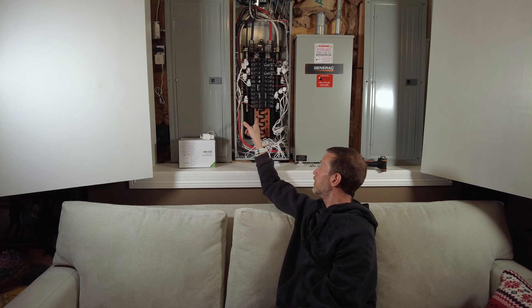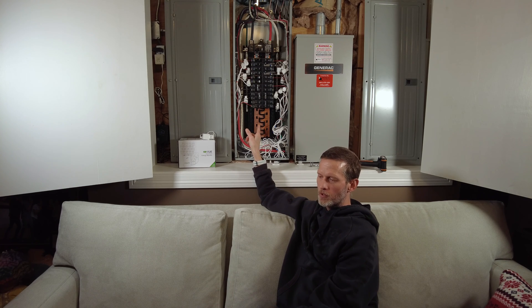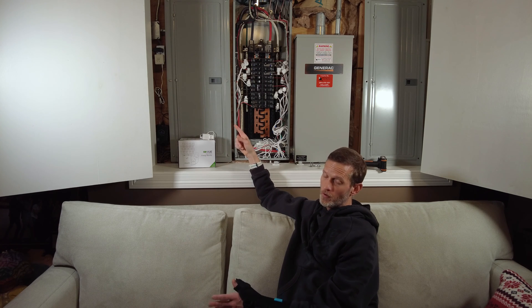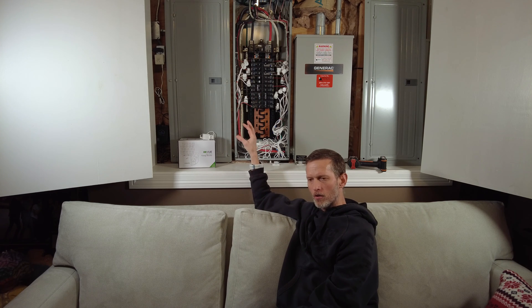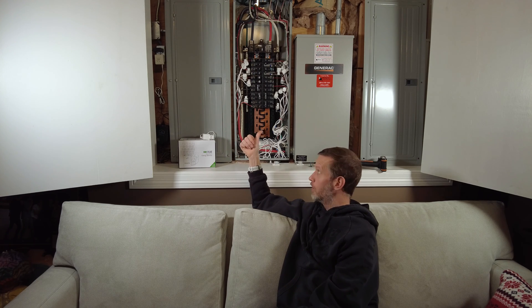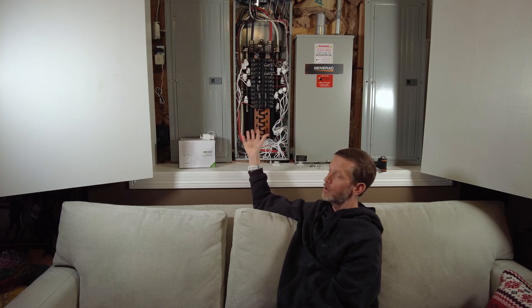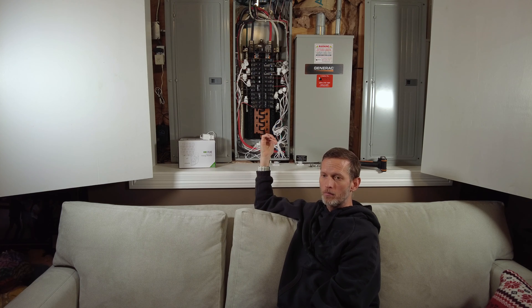As I mentioned, you need to install circuit breakers in your panel for the View. If you're not comfortable with that, it adds some complexity. You also, if you don't have a receptacle, would need to install one near your panel for the IOTAWatt. It's a lot easier to be safe installing receptacles because there's just one circuit to turn off. You should turn off the whole panel to install the breakers, but just be aware that the bus bars will be live if you don't.